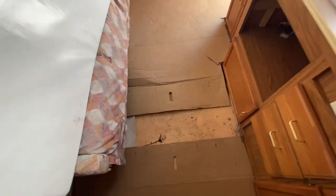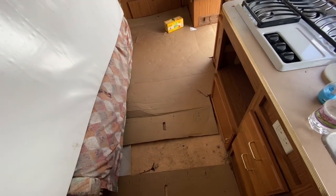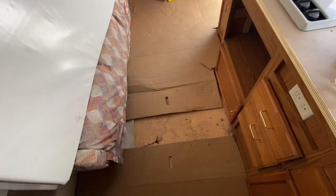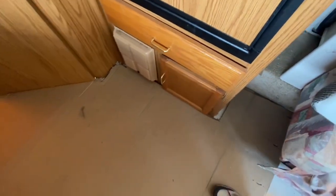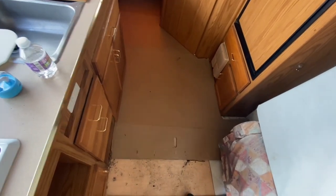What I did was take some sheets of cardboard and trim out a template all around through here and back this way as well. I'll take it out, lay it on some four-by-eight sheets of plywood, cut it, and bring it in. There will be challenges because in tight spots like this you have handles sticking out and doors with lips, so I'll most likely have to remove the doors to slide the plywood in. I'm getting ready to get the plywood out, put it on some horses, and cut.